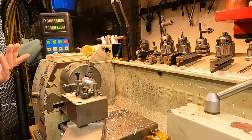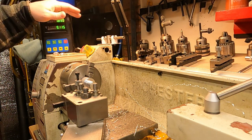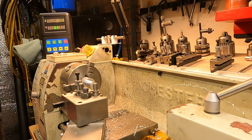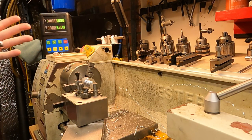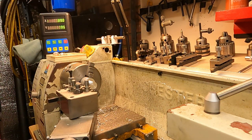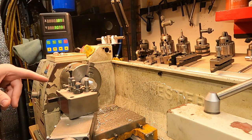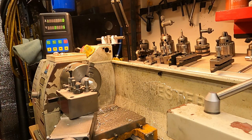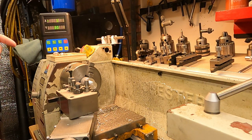You get a little bit of deviation — you can get deflection on the cut, down to temperature of the material, temperature of your workshop, et cetera. There are a lot of factors. Probably in the middle of summer it'll be perfectly accurate, but right now it's about 10 degrees outside. Although I've got the heater in the workshop, the machine itself is pretty cold, so it's definitely going to have different tolerances. That's why you see big machine shops always climate controlled. We'll get a collet and try it on there, and if I'm happy with that I can turn the work in the lathe and make a start on the dimensions for the tool.